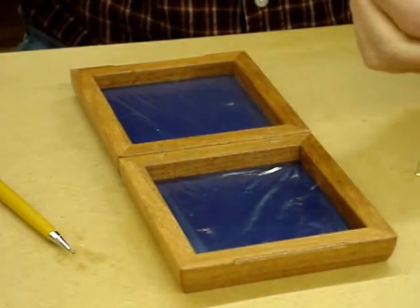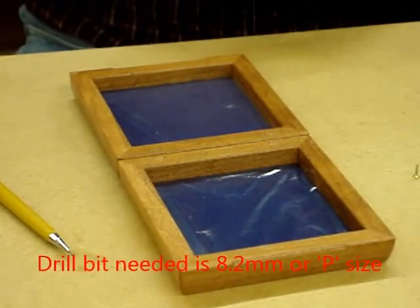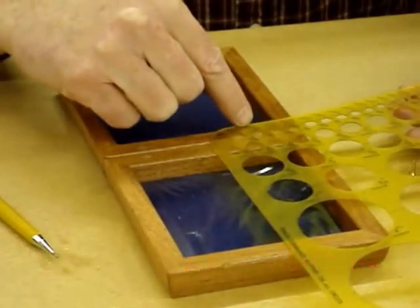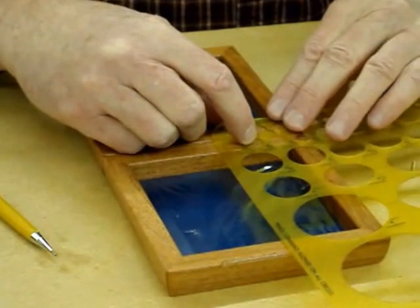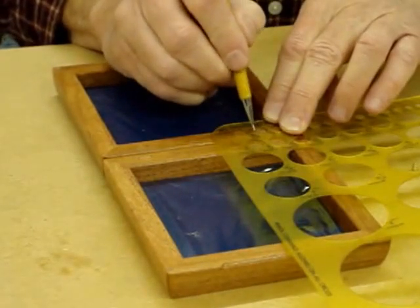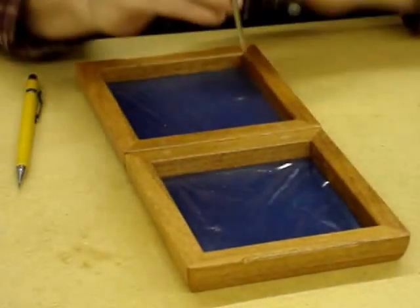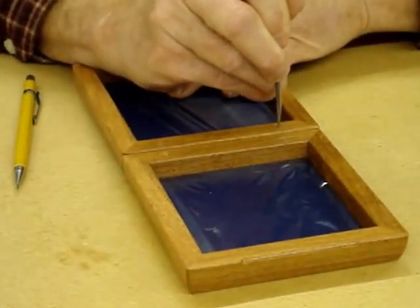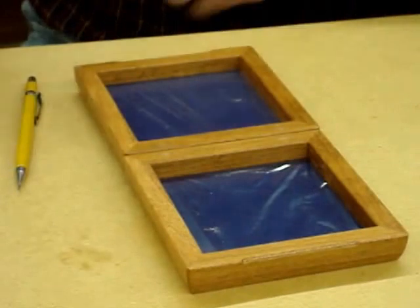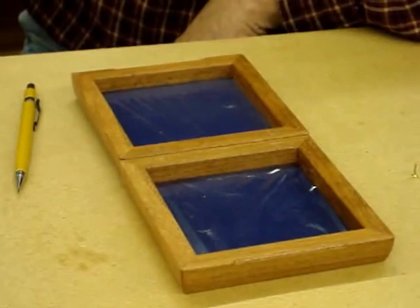By experience, it's going to be easier since I don't have the right size drill bit. To aid in that, I'll use a circle template and align the center of the hole against the marks, then use a fine point mechanical pencil to mark on that line where the holes will be. I'll take a scratch awl and make an indent on all three of those locations for drilling — that'll help me align the drill bit. Then I'll go to the drill press and drill these holes.